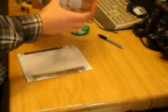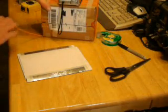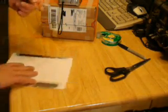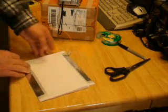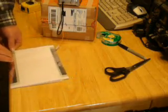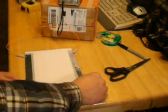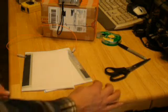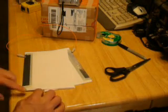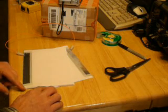I'm going to take my coil. I marked arrows on here that show me the signal goes that way or this way, and I know my station is in that direction. I'll set the radio back on here and turn it on — I can just barely hear a signal coming in. I'll use this clip to attach to the foil. If you don't have alligator clips, a paper clip would work, or you could strip the wire bare, lay it across, and use a stapler to attach it — just as long as you get a connection. You move the plates in and out to find the right spot to perk up the signal.